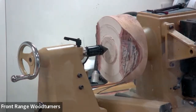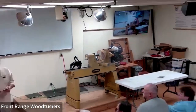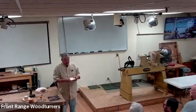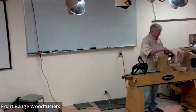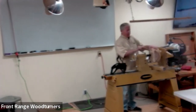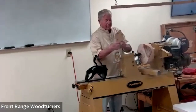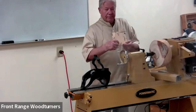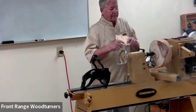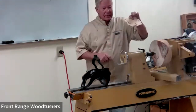This is a very expensive piece of Luan, and I have three chucks that I use mostly, actually four. So my large chuck, this is the dimension of the tenon, so I can put this on here and size up what size tenon I need for my larger chuck. The one I'm using tonight is my medium one, and I will turn a tenon this big. And then I have a gold thing from PSI, and that's the size. And then for my Rose engine, I have a little tiny chuck, and you can see that's how I mark the size of my tenon.